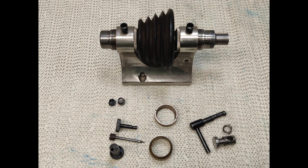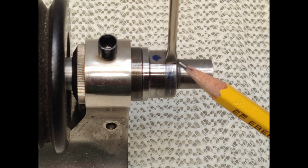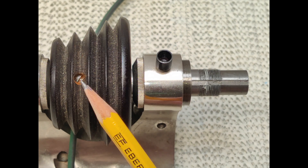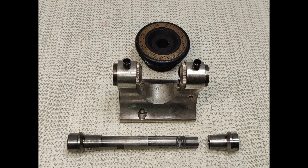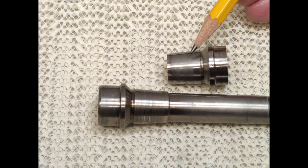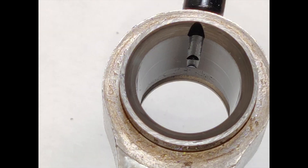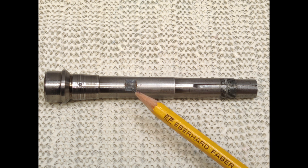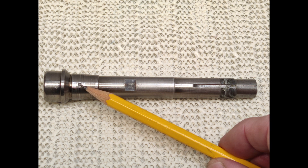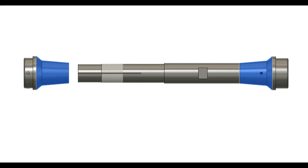First, remove all external parts. In order to remove the spindle from the head, the spindle locking nut is removed. A screwdriver can be used to loosen, and don't forget to remove the pulley screw. Use a soft hammer and gently tap the spindle until it's free. Once disassembled, the parts can be cleaned in a bath of mineral spirits. With the spindle removed, the bearing diameters can be inspected. Pay attention to three features of the spindle: at the tail end is the bearing keyway; in the middle is a flat for the pulley screw; and near the head is a locating pin that protrudes into the spindle bore, which aligns the collet keyway. The fact that these three features are in line will be helpful during the reassembly process.